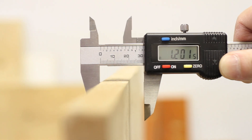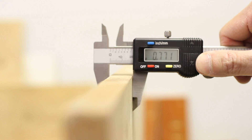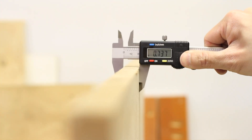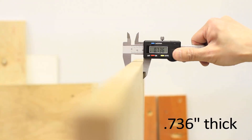With the spoil board now mounted, there are just two more things we need to do. The first is to surface or level the top of the spoil board. Sheet goods like this MDF are never a consistent thickness all the way through, so while we can't see it, this board may actually have a wavy top. This would affect the accuracy of our cuts, as pieces would not sit perfectly level on an uneven spoil board.